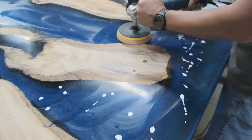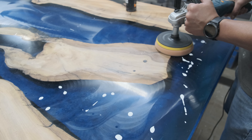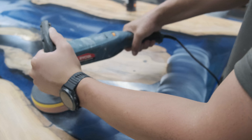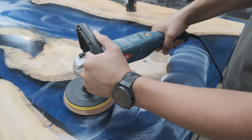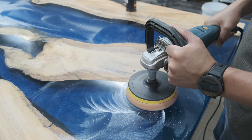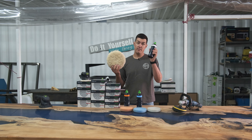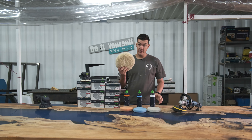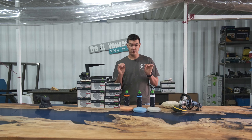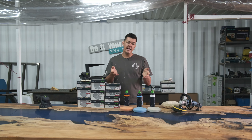As I polish, I add a few drops of compound at a time. I go to one side of the table, add polish all over — not a lot — polish to one side, add polish, polish to the other side. I do this three times — that's very important. Once done with the polish system, I move to a sheepwool buff with the white polish compound. Add a few drops and that's when you'll see the magic start to happen.